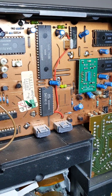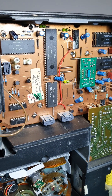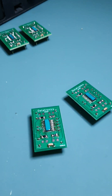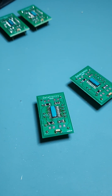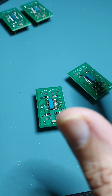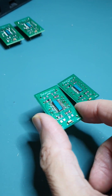If you just want to non-oversample it and don't want the reclocking, let me know because I can do that as well. These are convertible — these resistors here are to do with the non-oversampling part, and the chips plus the rest of the circuitry are what handles the reclocking.